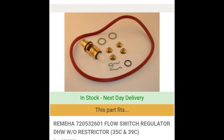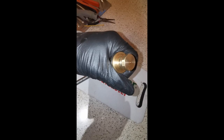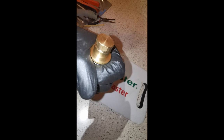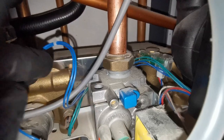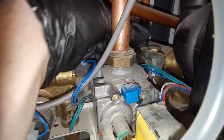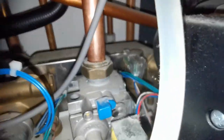Here are some screenshots of flow turbines — Baxi, Ariston, Ravenheat, Ideal, Potterton, and Mains. As you can see, the flow turbine is almost round, so there's not much to get a spanner on. This tool is ace for this. First, remove the hall sensor — twist it around to a point where it will pull up, then twist and pull gently and it will just slide up.